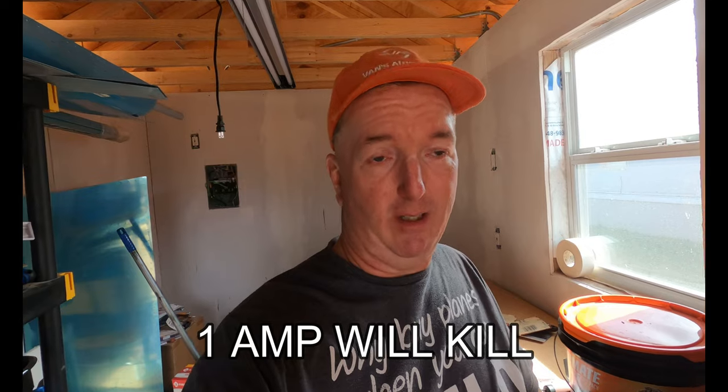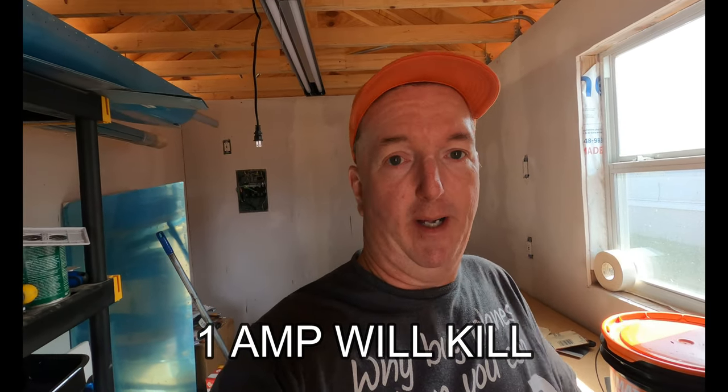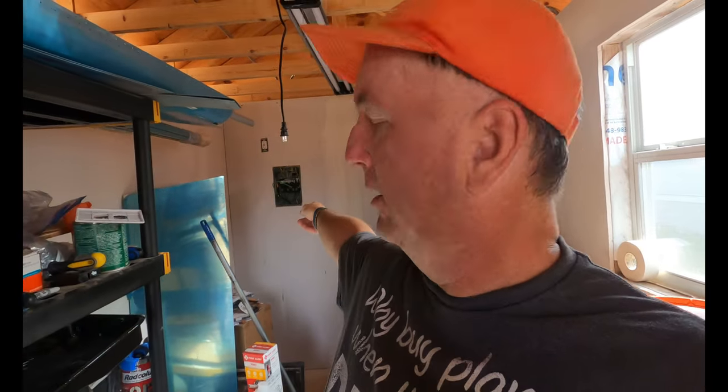That's a 200 amp panel, and I'm adding a 100 amp sub panel. There's already 140 amps being used, but Texas code allows for 1.5 times the amperage allowed through a panel. So I'm still well within. I can go up to 300 amps on that panel, and I'm still well within code.